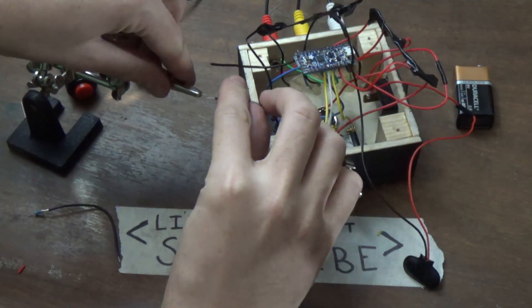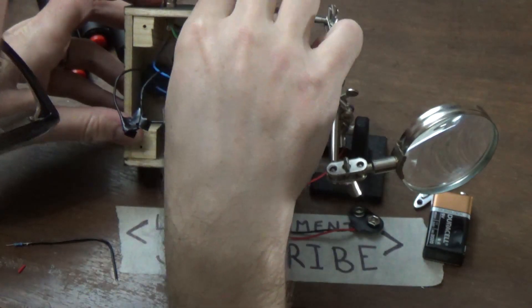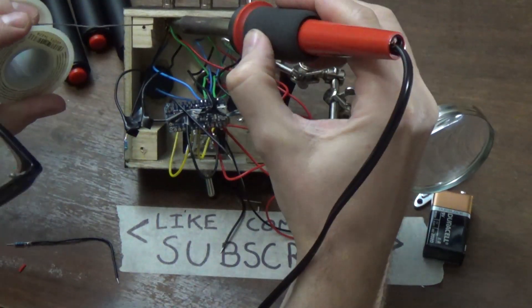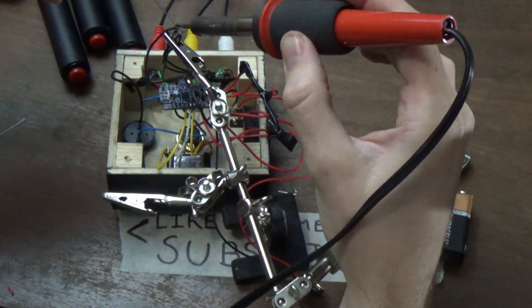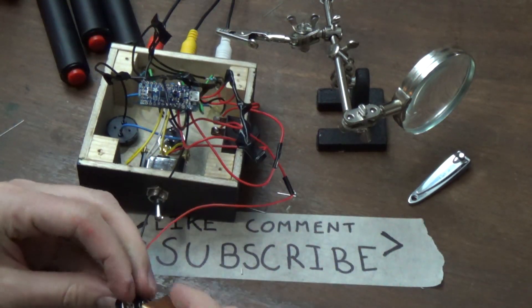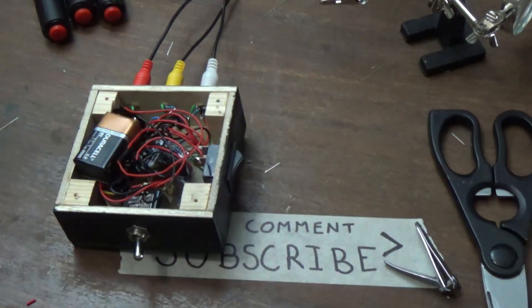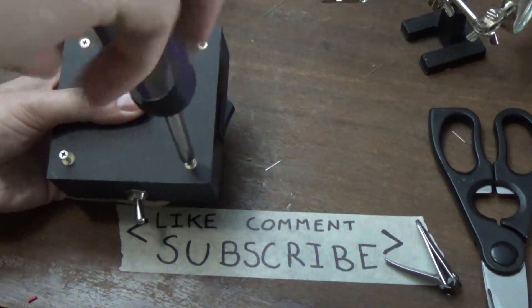This is where I realized I forgot to add a ground and resistor to my momentary switches. It's important to do this because if there's any residual electricity on that line it could make the Arduino think the button is being pushed, which can cause really weird behavior on your electronics. Once all that is complete I smoosh all the wires and battery in there and give it a try.